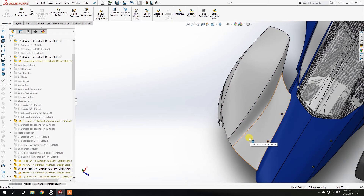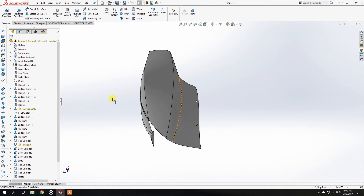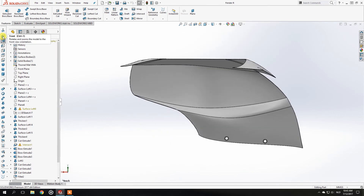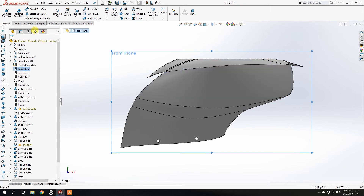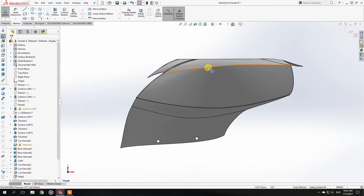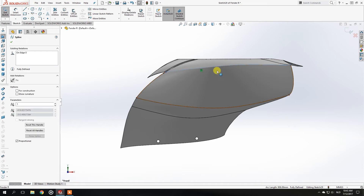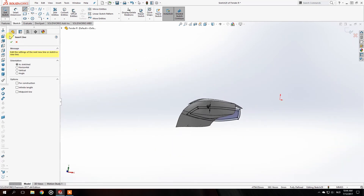The first thing I will do is go to the separate part and from the top view, search for the display and click on Extrude Boss Base. You can then select this face, click on Convert Entities, and I want to really follow the lines that are already there, so I will just offset the entities inward — about 40 millimeters.